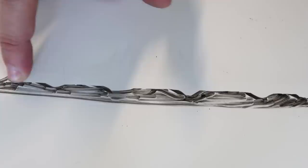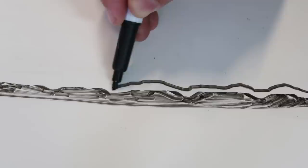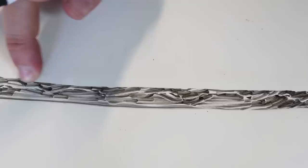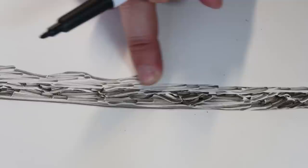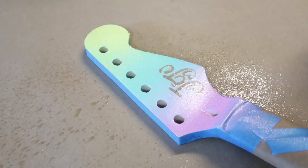So what we do is we sand it, and when we sand it, it sort of evens things out a little bit so we can get more of the lacquer into these pits — the pits are opened up a little more. Then we do the next coat, which gets a little thicker. It still goes on unevenly, but it is filling in some of those pits. Then we sand that down and we have more of a chance to get it smooth. We do another coat, which is also kind of messy, but we're filling this in. And then when we finally do our final sanding, we're just sanding straight into lacquer. There are no pits or anything to fill in and you end up with a nice smooth guitar.